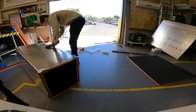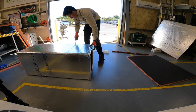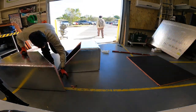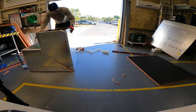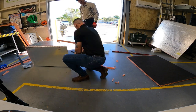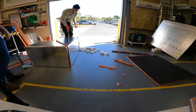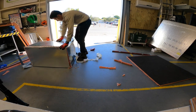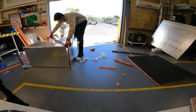On your tapered end you do have to make a 45-degree cut with a duct knife so you have a nice clean flush edge where they meet. This plenum came out awesome — German did a fantastic job, and he'd only watched this lesson one time. It's a very easy method. All you need is a T-square or a level and you can get this done. The math is much easier and simpler than the traditional way.